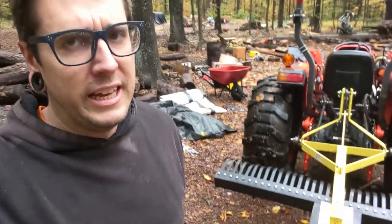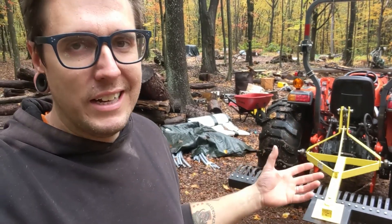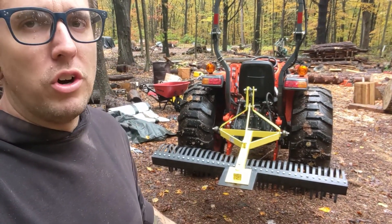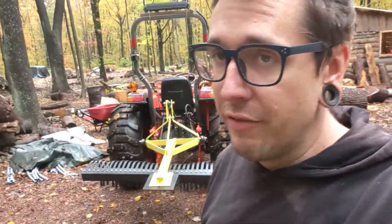The next Titan attachments thing I have is this landscape rake. I needed a landscape rake because we get all these wood chips and we have a lot of paths through the woods and even near our house, and also even our gravel driveway - just to maintain that kind of stuff. I was looking at a land plane and a box blade and all that kind of stuff, but I really just needed a rake. I wanted to get a six-foot rake so that it covered the wheelbase of my tractor - it's just a little bit wider than the tractor is wide, so when I'm dragging it behind me, whatever tracks I create are then covered up.